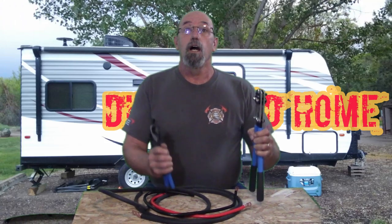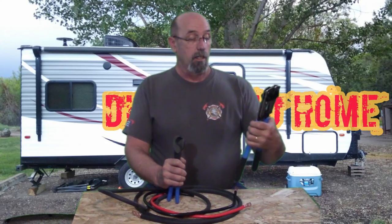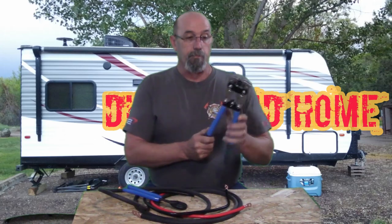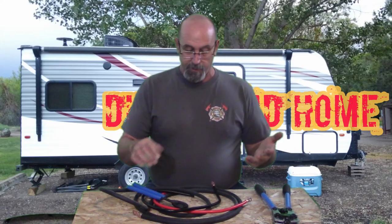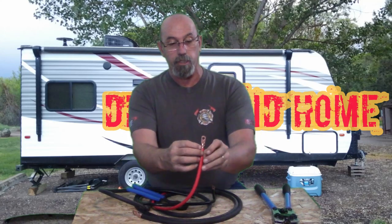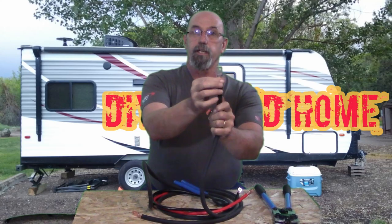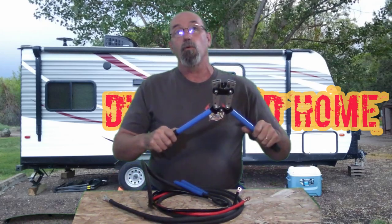So what do I think about these? For small projects, one-off projects — something you're just going to need every now and then — for about $35 for the pair, it's not a bad deal. You've got multiple sizes with dies that are permanently affixed so you're not going to lose them. It did a good job of crimping the lug on and I'm not worried about it falling off. Depending on the style and quality of lug — how thick they are, from paper thin to extremely thick — you're going to have different performances. You can see that one lug pinched and had little ears, yet this other one crimped down really nicely. That all plays a factor into how well the crimper works.